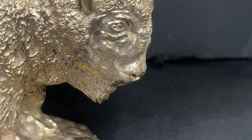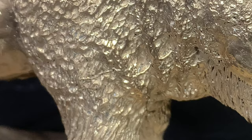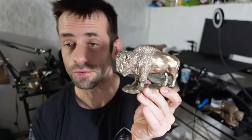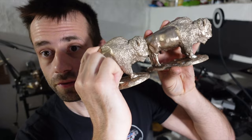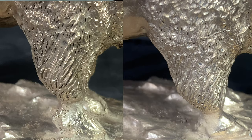So in the end, which one is better? It's really close — both of them turned out really well. Apart from the ceramic shell breaking, the ceramic shell surface is very smooth and very uniform with a very high quality finish — really no defects at all, just a very small bit of flashing, a few pinpricks on the hindquarters, and very minor inclusions. For the investment casting, I feel like the detail is a little bit sharper — for example, the hair around the foot is just a little bit deeper. Whereas the Suspenda Slurry model is very slightly smoothed out.